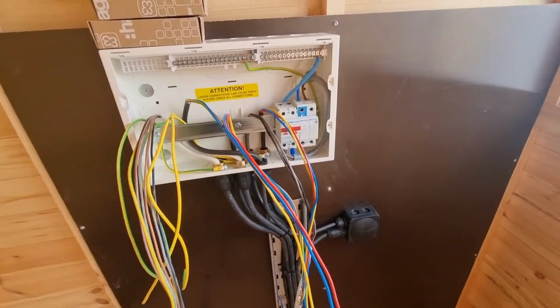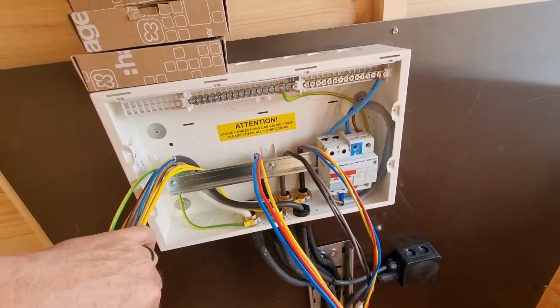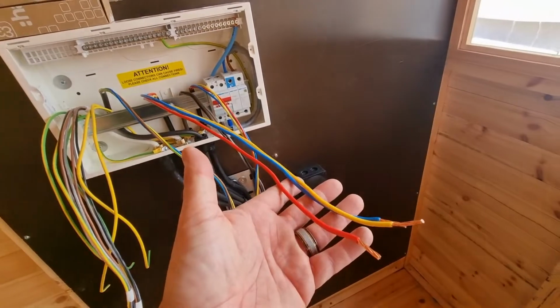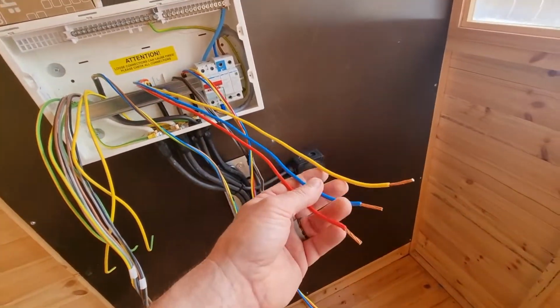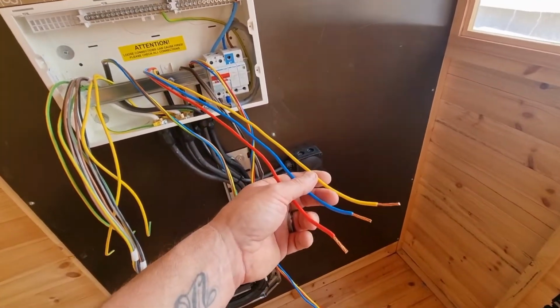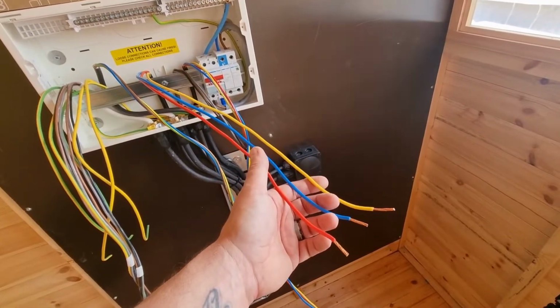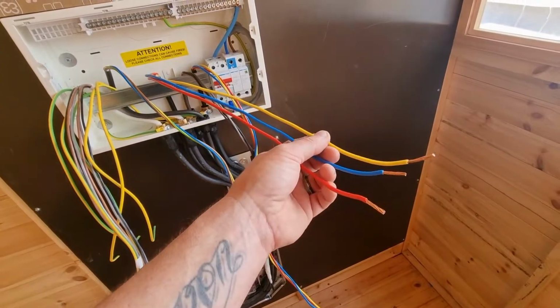As you can see, what we've done here so far is I've stripped all of the cables back so they're all ready to connect in. This one should be the main feed into the board. So what I want to do is go to the mains cupboard, find this particular cable, disconnect it from the board. We'll put a link in and then we'll do a little bit of testing to make sure to verify